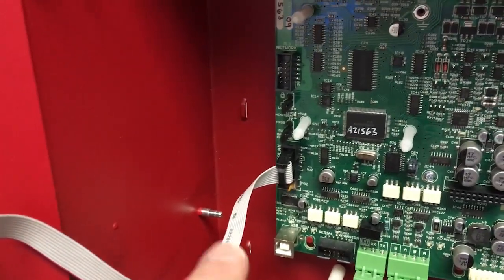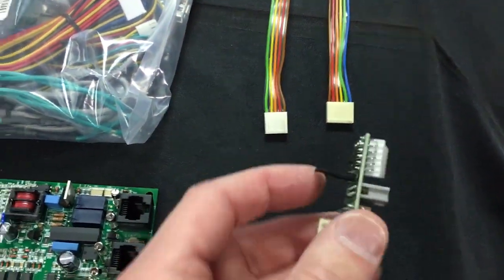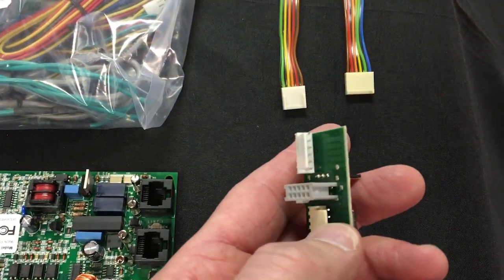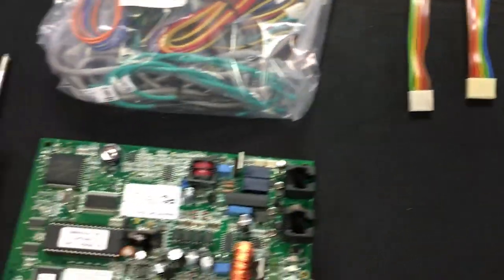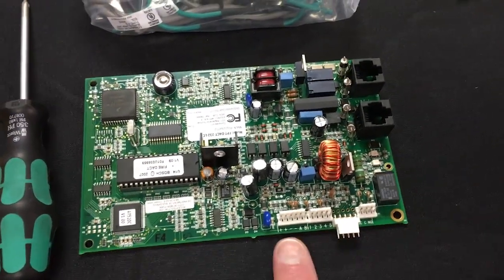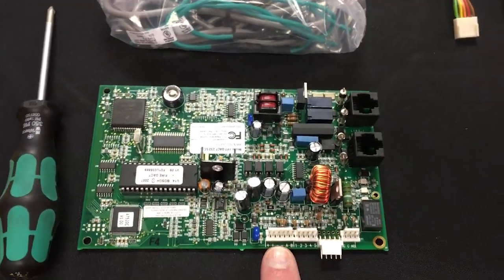I've powered down the panel so I can pull off the ribbon cable for the display to get it out of our way. Coming down to the SEB card — on the back you'll notice there is a socket that will plug into the main motherboard. There's a six pin connector and also a five pin connector. We'll put the two ribbon cables into those and then install them onto the digital communicator. We use the five pin on the header that points in the opposite direction of all others, and the six pin goes to the one that has six pins.